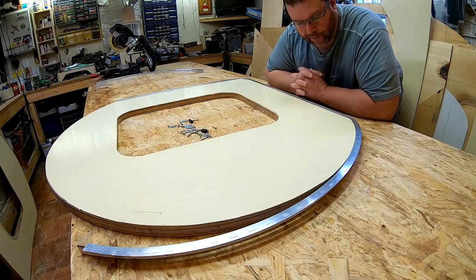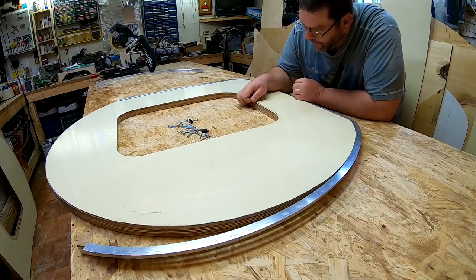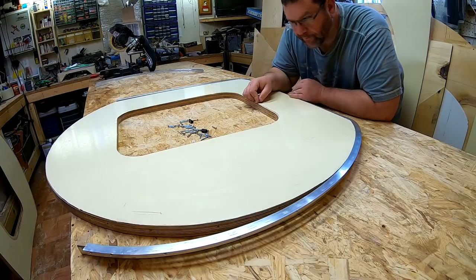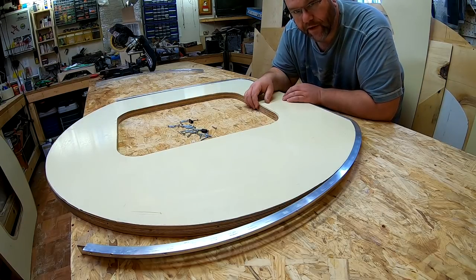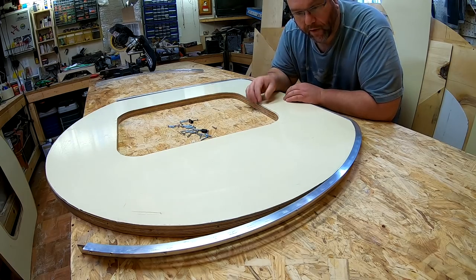The thing I'm really wanting to make sure of is that I'm adding about 40 thousandths thickness between the T trim and the door, and I want to make sure that the screw holes still line up. They should be okay if it's only a 40 thousandths offset — it should pull itself together — but I want to make sure before I put the caulk down.